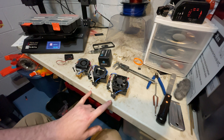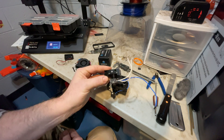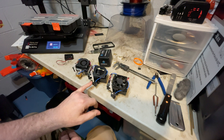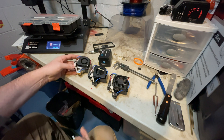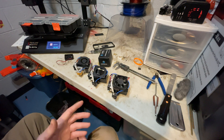They sent me a heated block and a cooling block replacement, and I still had an issue, so they sent me a brand-new high-temp extruder with everything included. They've also sent me a brand-new low-temp extruder. I recently had a problem with my heated bed plug — the solder joints failed, which was just an issue with not having strain relief on the cable. They replaced that and sent me a longer cable with instructions to use a zip tie.